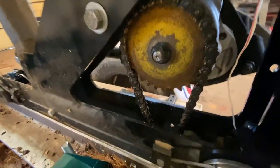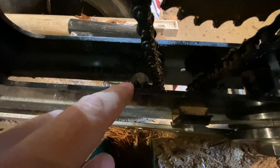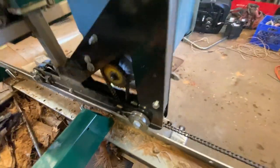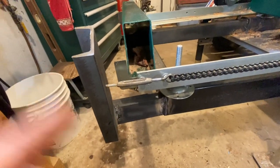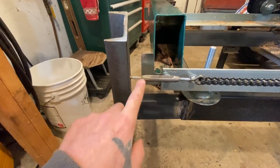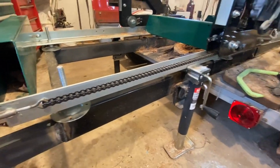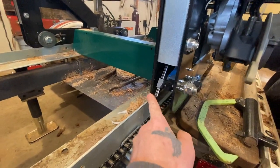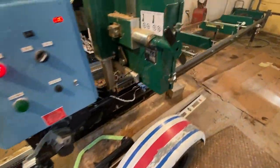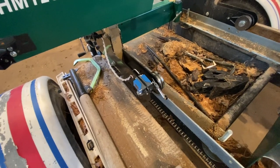The chain runs from one end to the other. There are two slave pulleys in there to keep that chain nice and taut — the chain goes underneath that pulley, up around, and then underneath the next pulley. On my custom-made trailer I put vertical risers in with a turnbuckle so I can tighten or loosen that chain, and I'm running what I think is #40 chain all the way down to the other end. I put two stoppers on here so I don't even have to monitor the mill — there's a stopper on each side and it'll stop when it gets to the end on its own, either forward or backward.